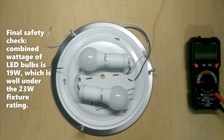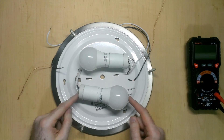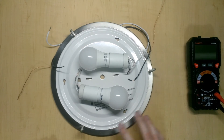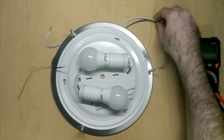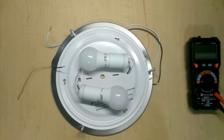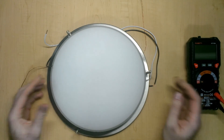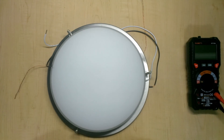The last thing I did was pull back on these light bulbs a bit so that the bracket is bent and the light bulbs are not actually touching the chassis. That helps make sure there aren't any hot spots due to heating of the light bulb in one particular area. Let's make sure the diffuser actually fits - if it doesn't I'll have to drill some new holes, but that doesn't appear to be necessary. Everything seems fine, so this is good to go. I'm going to install it back on the ceiling, turn the power back on, and see if these light bulbs light up.